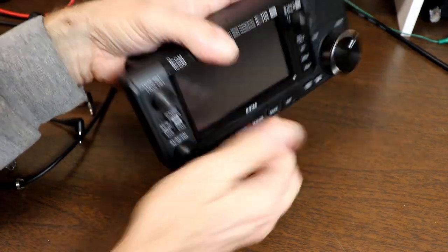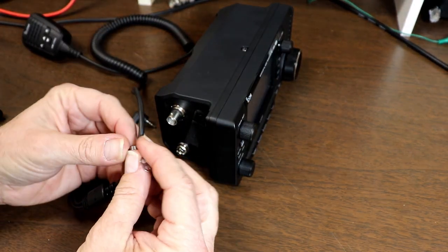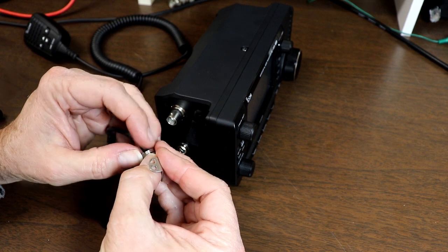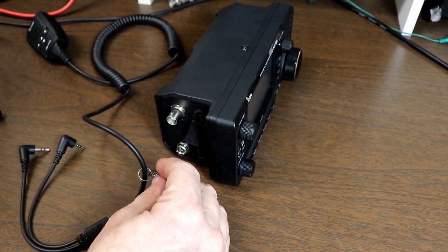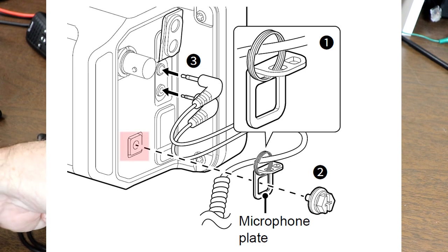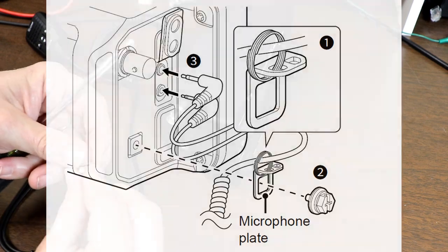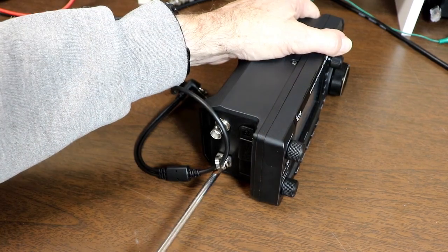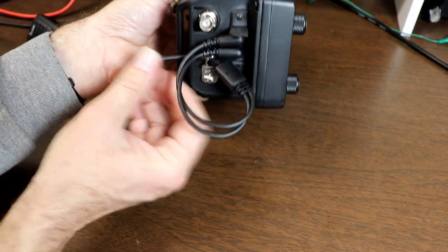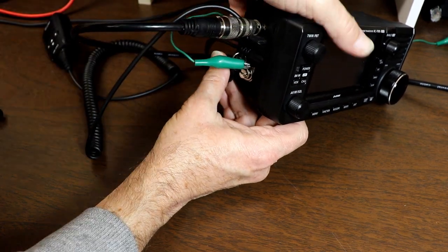Now let's install the strain relief bracket for the microphone and speaker cables. There's a spiral keyring-style ring that's pre-installed on the mic cable — you twist that through one of the two small holes on the bracket. I tried both of them and it doesn't really seem to make a difference either way, so take your pick. The bracket screws onto the ground screw, and there is a square boss around the ground screw hole that keeps the bracket from spinning once you have the screw tight. Then just plug in the mic and speaker connectors and you're done. The arrangement provides plenty of strain relief, but the large loop of wire that it leaves seems a little bit awkward. For the ground connection, I just clipped an alligator clip to the strain relief bracket and to my station ground. It's definitely not the best arrangement, but it's something for a temporary setup — we'll see if we can come up with something a little better in the future.